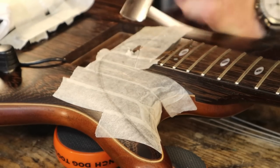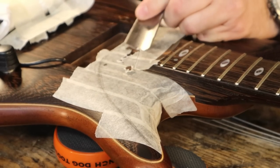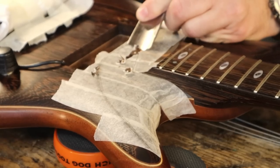When you watch a violin maker carve a violin top, something like that, you go across the grain for most of the work. And right at the end, once you've got the shape where you need it, then you start scraping and finessing and going all over the place.